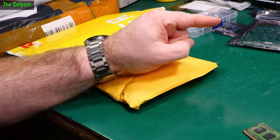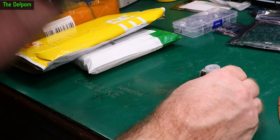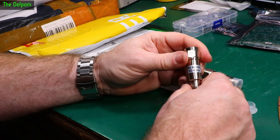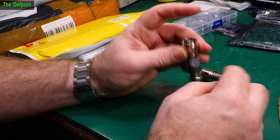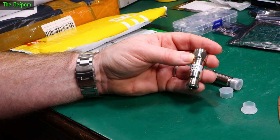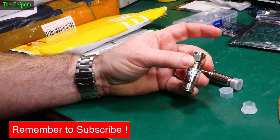The reason I got that board is because I recently got an SSA 3021X Plus, and it's now a VNA. When you have a spectrum analyzer or network analyzer, you'll often want to put a DC block on the front of it, which is what these are — apparently DC to six gigahertz. A lot of spectrum analyzers cannot tolerate any DC whatsoever. You put DC into the front of a spectrum analyzer and a lot of them will just go bang. You lose your front end and that's it.